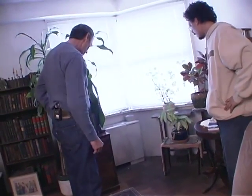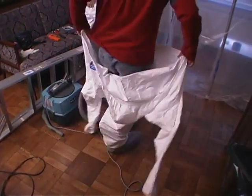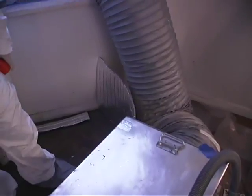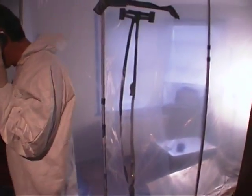What we would call dense, visible mold growth is covering a pretty big area. Make sure that both you and the workers are protected from contamination. They should wear protective suits and respirators. The space being fixed should have what's called a negative air machine within the plastic barrier, and all debris must be safely disposed of.